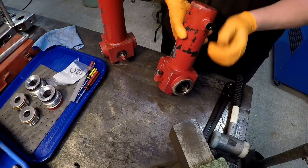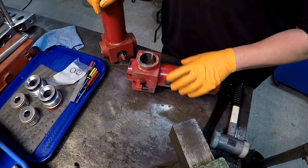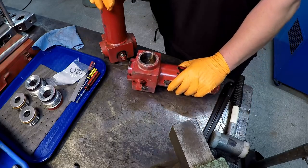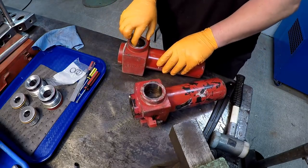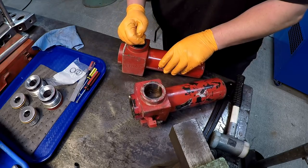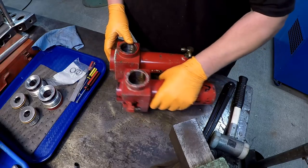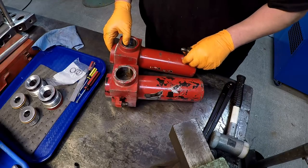The two small ones we're going to have to wait on putting together. The reason is these trunnions take a needle bearing, which I removed. Fernando had said that when he took them off the needles were falling out - that's why he had tape around them. They were all trash, they had rust and the needles were falling out. So I've got four new needle bearings on order. I ended up having to pry the cage out of the old ones - I took a carbide router burr and split one side, then was able to grab it and pull it out. I've got the new ones on order and they should be here this week.